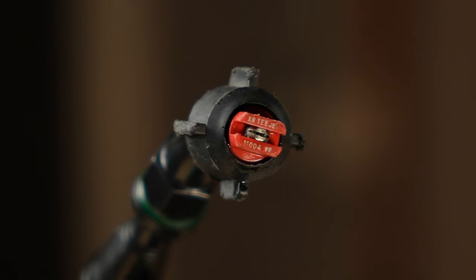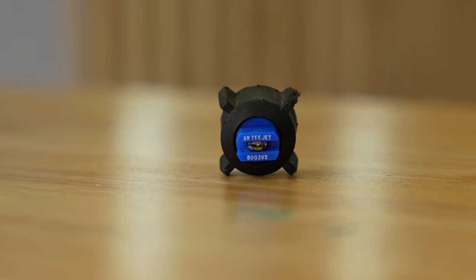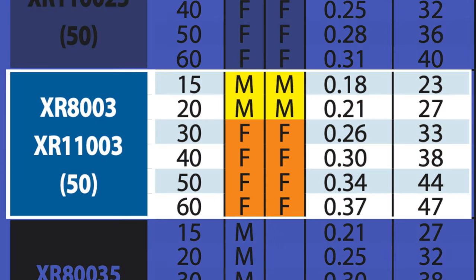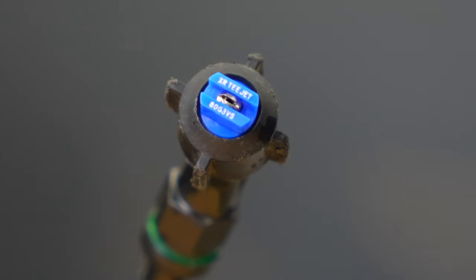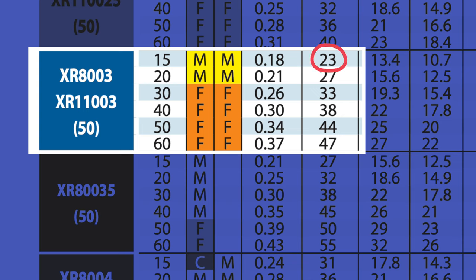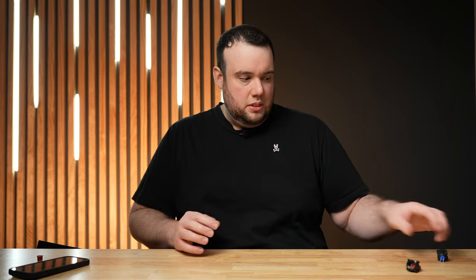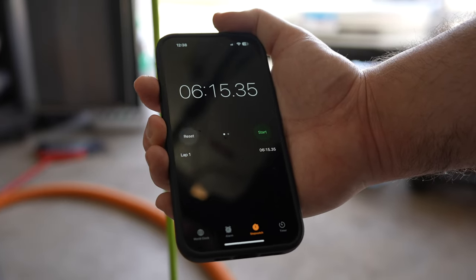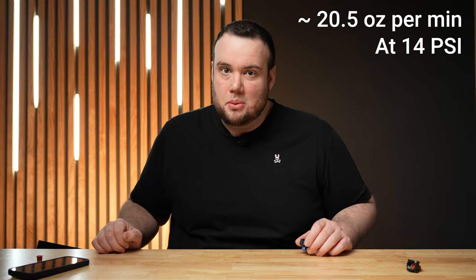Typically I like to use 110-degree fan tip T-jet nozzles on my more expensive sprayers. But since this sprayer has a much lower PSI, I started experimenting with different types of T-jet nozzles that are more optimized for lower PSIs, and I think I found one that suits it very well. To fully optimize our output, we go down the T-jet totem pole to a nozzle with a smaller orifice to create more pressure. What I landed on is this blue 80-degree T-jet nozzle. This blue T-jet outputs 23 ounces per minute at 15 PSI. I timed it: it took 6 minutes and 15 seconds to spray one gallon, which equals 20.478 ounces per minute — putting us just under 15 PSI, more in the 14 PSI range.